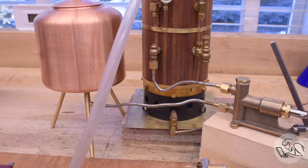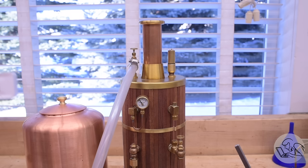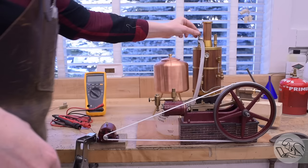Alright, time to kick the tires and light the fires. Burner is lit. A minute later, the clock is off the pin — we are officially making steam. Pressure is building in this boiler. This boiler is quite the little demon — it makes steam very, very quickly, but it doesn't have a lot of capacity and goes through water really fast, so it needs that feed water system. The burner lets it down a little bit — this is a ceramic burner I made myself and it's not that great. Almost immediately the CO does start to register, showing 39 parts per million, so time to open the door. It's minus 25 outside — I was hoping not to have to open the door, but safety first. With about 25 pounds on the clock we can start doing some other prep work.